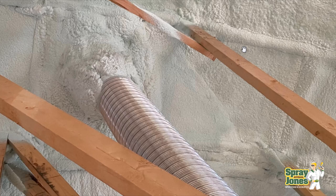Hopefully in time this will get manufacturers to publish an advisory bulletin on how these should be detailed. The evidence is here — spray foam can be sprayed to it, it can handle it, and it should be sprayed to the underside of the deck and the thimbles to seal the entire unit up airtight. That way you won't have a condensation problem, a roof deck degradation problem, or a spray foam degradation problem. Leave a comment — tell me what you're doing in your county, state, or province. How do you handle these? Share, like, subscribe, and I'll catch you in another video.